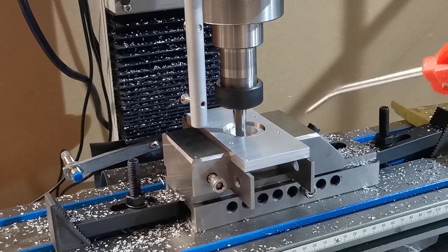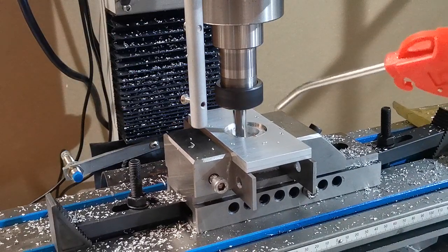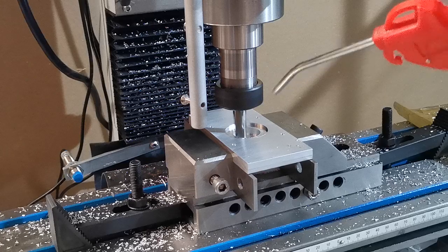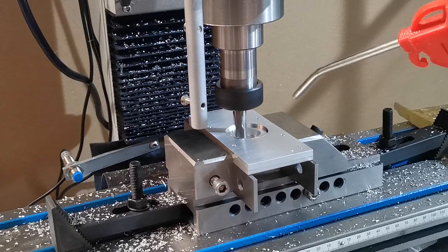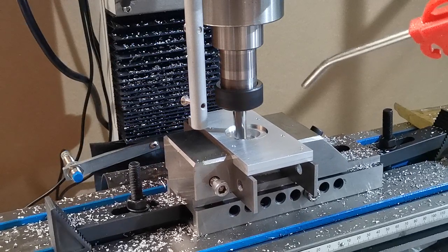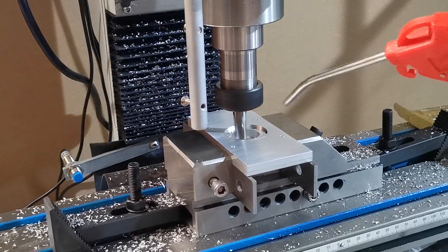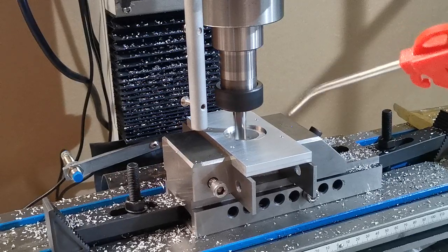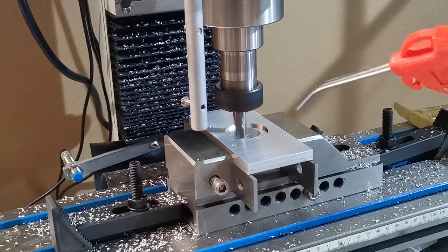We're at nearly 8 millimeters now. Obviously the deeper it gets the more we need to keep the airline on. With the semi-automatic tool change you can see it could make your life a lot easier when you've got programs with four, five, or six different tool changes, without having to re-zero your part — especially if you've skimmed the surface or are machining many surfaces with no good reference point.